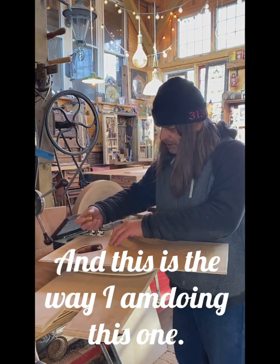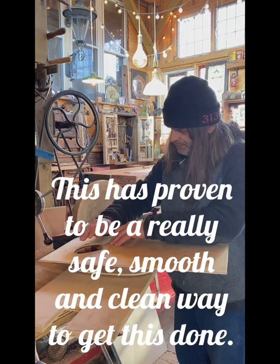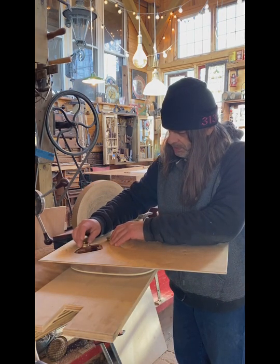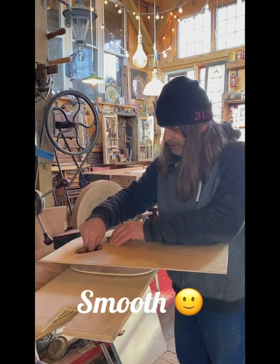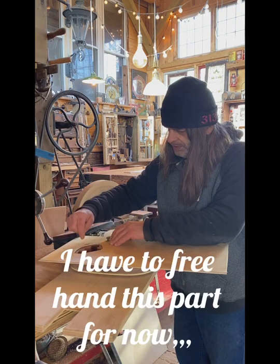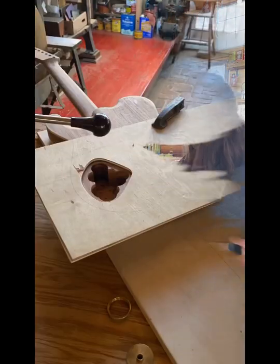With our small collet, that'll follow around. I'm going to countersink for the access plate and then come back with a larger collet, and it'll go all the way around and get all the way down in all this bulk, clean it up. But I penciled in right here, and right here, where we could have our 3 screws to hold that plate down. And I'm going to go ahead and do all that right now.